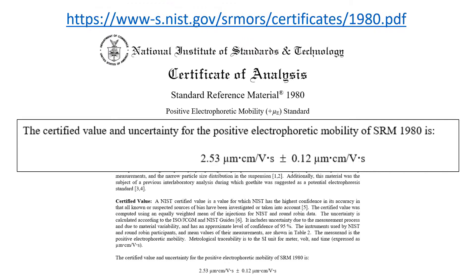Of course, they could specify the mobility, but they don't. Because this standard is mobility, you should be able to test it on any instrument and not worry about which model was used to calculate zeta potential. However, the standard is used at a few millimolar ionic strength. If you are measuring samples at higher than that, it doesn't follow that measurements on one instrument will be the same on another for all the reasons given before.